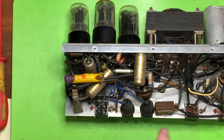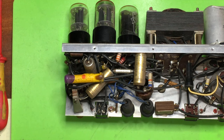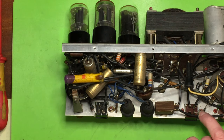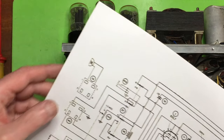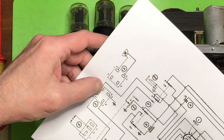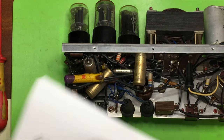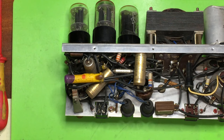As I've mentioned before, I'm a bit unhappy with the wiring system on this. Mains input has pin 1 live and pin 3 ground, and the circuit shows the microphone wired between pin 1 and 3 on the 4 pin connector. So if you plugged the microphone cable into the power cable, things would get a bit unpleasant.